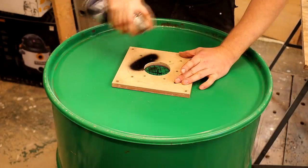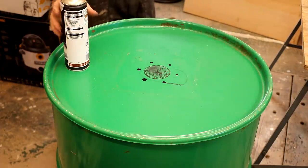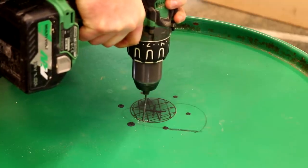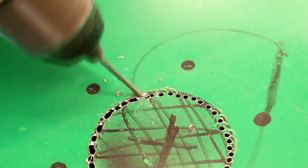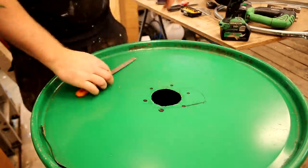The person who made it would have added that to reinforce the plastic lid on the old small bucket. I had the idea to use a bit of spray paint to mark up the holes as I couldn't find a pen to fit through them, and that kind of worked but some of the paint leaked through so it wasn't very accurate. I then drilled a series of small pilot holes around the perimeter of the circle. The correct tool would have been some kind of metal cutting hole saw bit but I don't have any of those, so it's one of those situations where you do the best with what you've got to hand. Once those holes were drilled I could put the drill bit into each hole and kind of wriggle it around from side to side to try and join the gaps. I also tried using a hacksaw blade to cut away some of the remaining material, and eventually I could peel away the waste with a pair of pliers. Then it was just a case of using a round file to smooth over the edges to refine the shape of the opening until the cyclone fitted in there snugly.